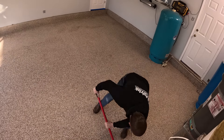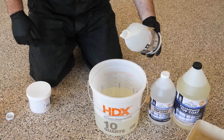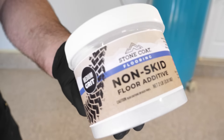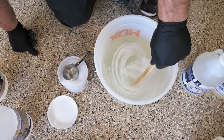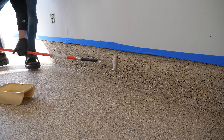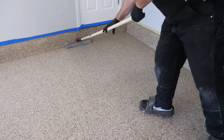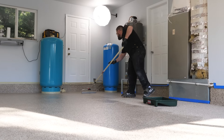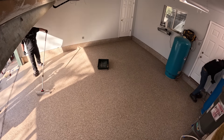Before using the polyaspartic top coat, prep any area that touches the epoxy with tape to avoid getting the top coat on places you don't want it. Measure out one to two ounces for each square foot of floor. Mix the top coat with a paint stick or paddle mixer on a drill for two to four minutes. If you want it to be less slippery, add two ounces of our non-skid additive for light grit, three ounces for medium grit, or four ounces for heavy grit per every one-and-a-half gallon of top coat. Apply the polyaspartic top coat with a quarter-inch microfiber roller, rolling front to back and left to right for an even coating. Once done, remove any tape and make sure there are no high points or piles of flakes before letting it cure 24 to 48 hours with temperatures above 65 degrees.